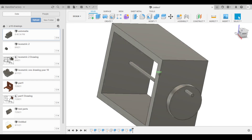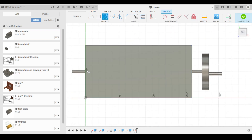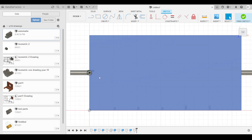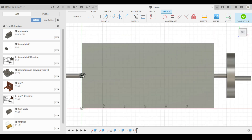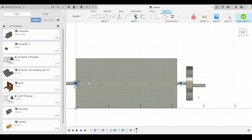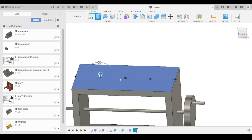Next thing — we can use the power of the computer here. I'm going to go to the top view and draw a sketch on this shape. We're going to find the center of this line, which is about there, and I'll draw a 5 millimeter circle there. Then we'll do a rectangular pattern of that shape, going in that direction, with 5 of those shapes out to minus 160. So we get a few different patterns in there — we've got 3 shapes there, which is perfect. We're going to close that off and extrude these shapes down — one, two, three — and take that through as a cut.